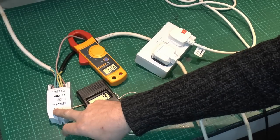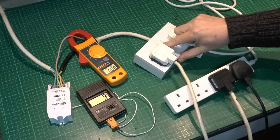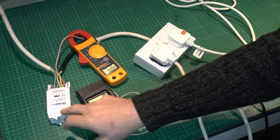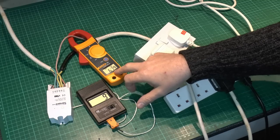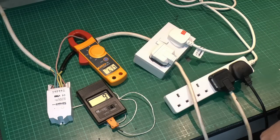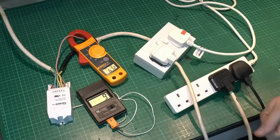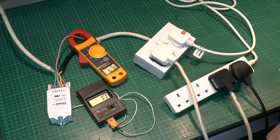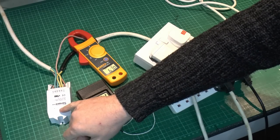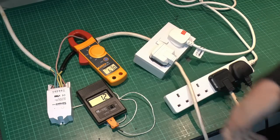I just turned it on — you can see the little blue thing flashing, so it's trying to connect to Wi-Fi. We'll start out with just the first electric heater. We turn it on and we can see the current is 6.8 amps, so that's heating away. We should see the temperature rise a bit. It shouldn't rise hugely, but putting current through any kind of conductor generally causes it to heat up because of course it has some resistance. We can see it's just increasing to 10 there, and we can see the little red light that's come on, which indicates the power is connected.